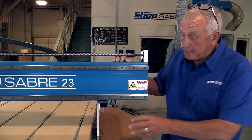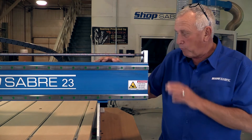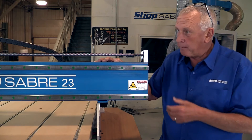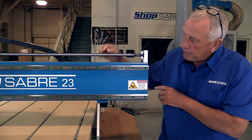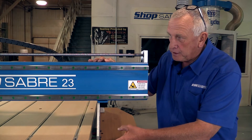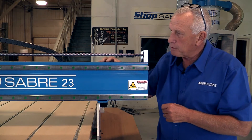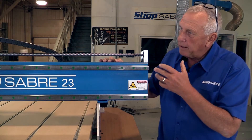The other frame components are the uprights that support the gantry and the gantry itself — we saw that gantry weldment right out of the welding shop. It's all steel. Attached to the gantry, you can see these precision contour guide rails. You'll also find those in the Y axis and the Z axis, and you'll also notice these ball screws — we use ball screws in all the axes.